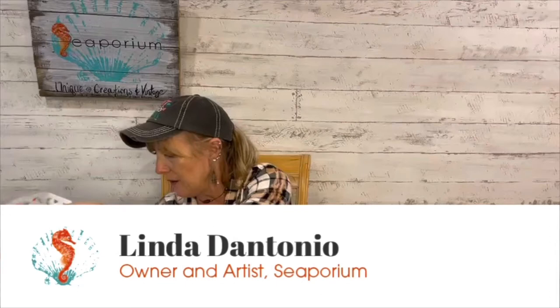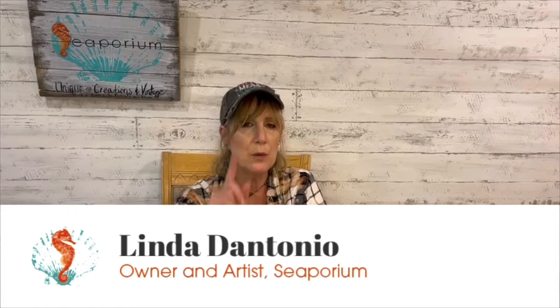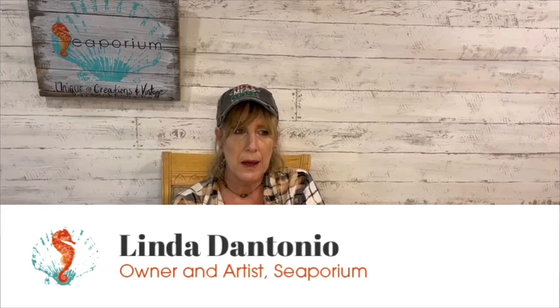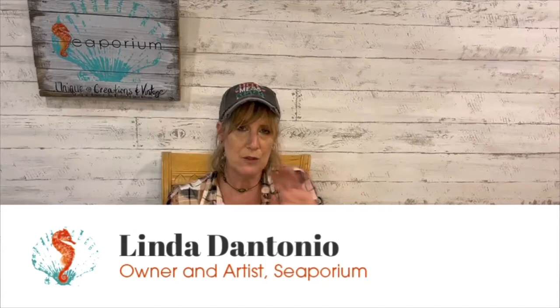And again, this is all new to us. We might be tweaking this as time goes by and people are trying all these new paint brands. We're working with the Dixie Belle chalk mineral paint. This will not be a great product for the silk line of paints from Dixie Belle. It does need some open time to work best. The more open time you get with your paint, the better off you will be. So chalk mineral paints, chalk paints, clay paints, all that, okay?